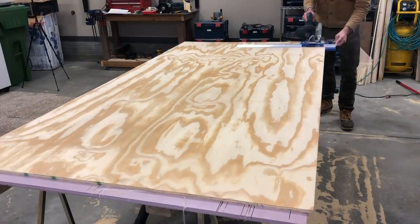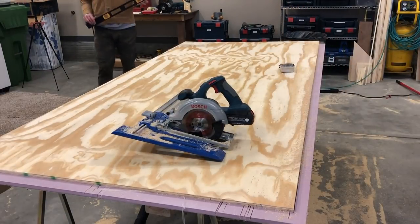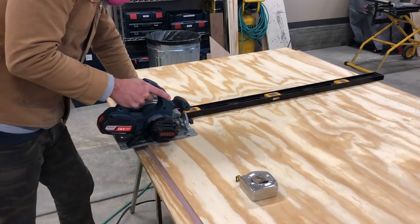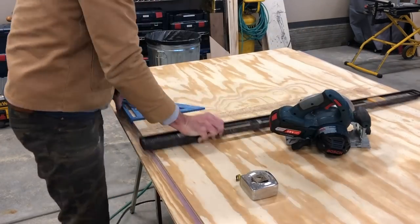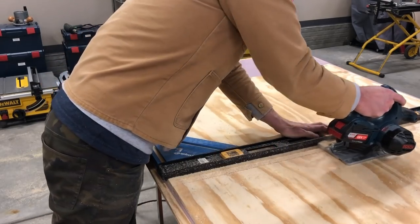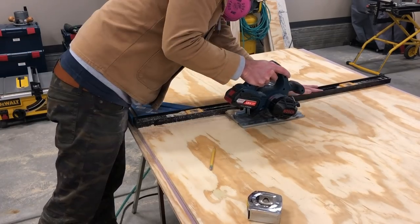Grab the plywood, cut the width. Next, you need a straight edge. In my case, I used a 4 foot level to get the height of each sawhorse. Go ahead and measure for the higher height, 2 feet, 5 3/4 inches, because this is a template. After you get the first one cut, you can pull the other one across and use it as a measurement for your other 3. So cut sawhorse number 3, then cut number 4 off that other sheet.